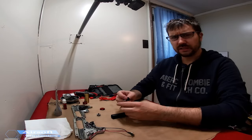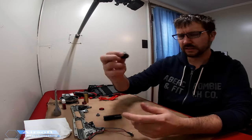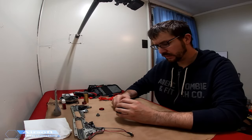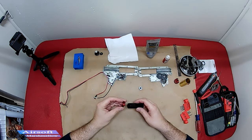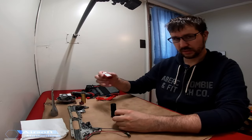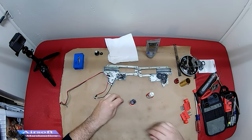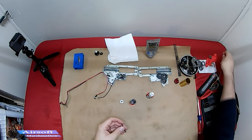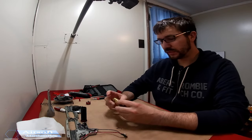When you're taking off piston heads, always check inside to see exactly how the setup is. For Krytac they've got this specific setup — some just have a screw-in, so double check your own when doing that and make sure you don't strip it out. For attaching the piston head it's pretty simple — it goes right in through here. For the screw, always, always use Loctite because if you don't, within a very short number of rounds it will loosen itself — we're talking maybe less than 50 rounds, not even kidding. The Max piston head is now on the piston and ready to go.